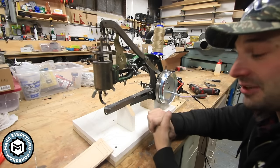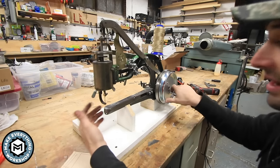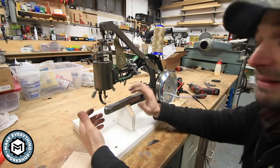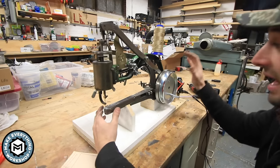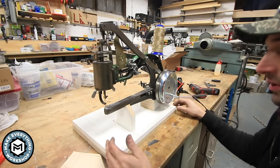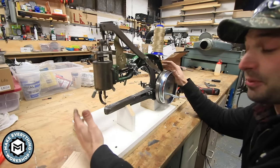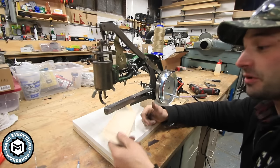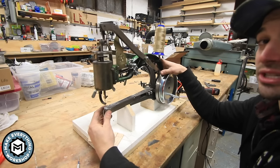But for the stuff that I do, to be able to have two hands to control the workpiece and also not be sitting there cranking, but still have the ability to forward and back stitch with this, still having this pulley face mounted to the original flywheel, this is a success in my mind. Like I said, I spent a lot of time trying to figure out how to do this, and I'm really, really happy with this. So if you buy the machine for $115, spend $50 on the motor and all the other little stuff, and get some plywood scraps from Home Depot or from your local lumberyard, you can have yourself a super capable machine that will easily sew two pieces of Veg Tan leather. I've sewn four pieces of Veg Tan with this machine without problem. So I think this is something that everyone should do to their little hand crank sewing machine.